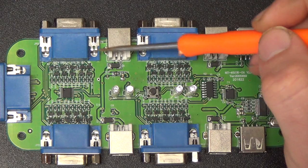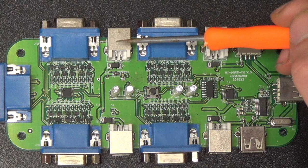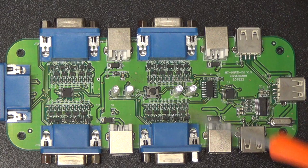I2C protocol runs on a couple of those pins for monitor capability detection too, as far as I recall, but that'd only be a couple more. That'd be 7, so that would leave us with 3. Maybe they're switching the separate signal ground returns too, instead of tying them all just to ground on the board. I don't know. Anyway, fascinating.